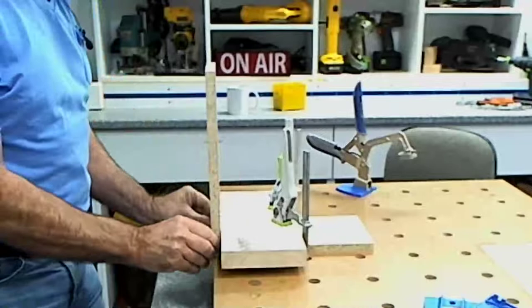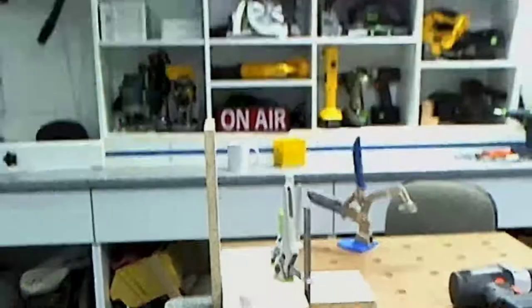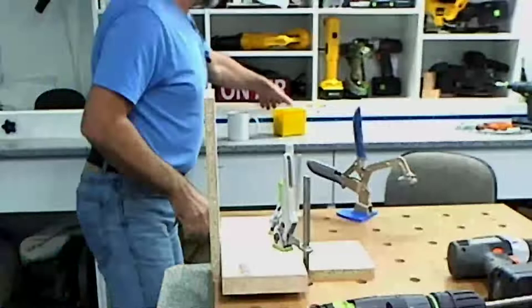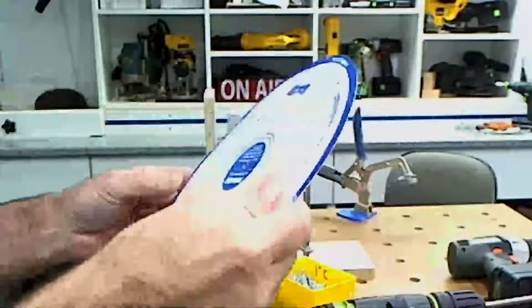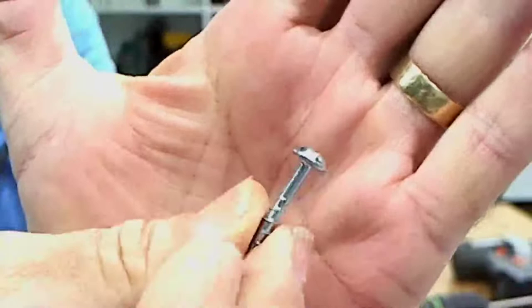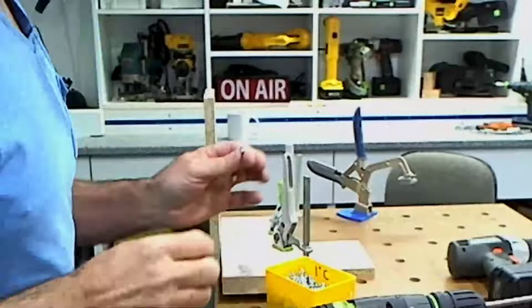Now, the screws. I think I can turn that up just a little. Maybe. No, you don't need to see the back of the screws. There's only a screw going in. Now, the jig, that little round wheel, told me, let's see where we're up to. 5/8 to 5/8 is saying 1-inch screw. Now, don't get confused with the 1-inch screws. I always use the pan head screw from Kreg. I don't use the micro screw, which has got a different head, unless I have the micro jig, which is a different size drill bit. It's smaller, it's designed to work with, and goes down to a 3/4.